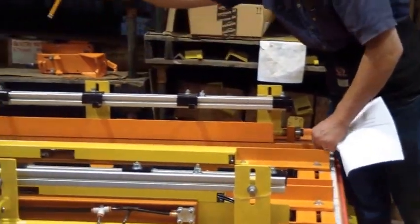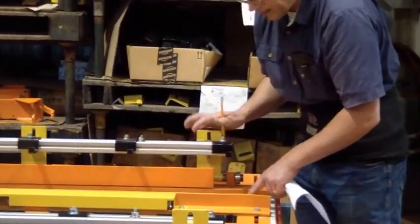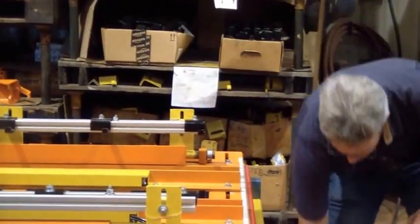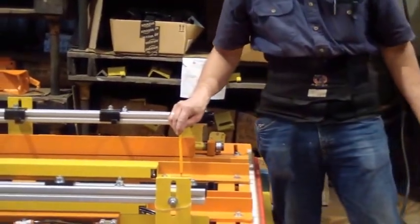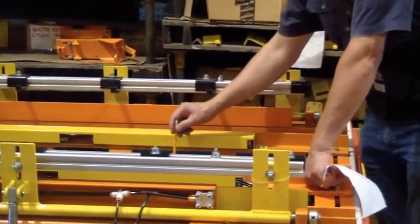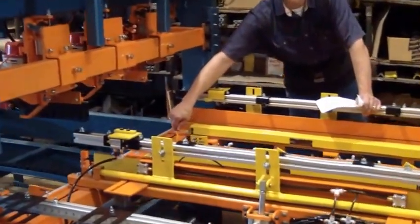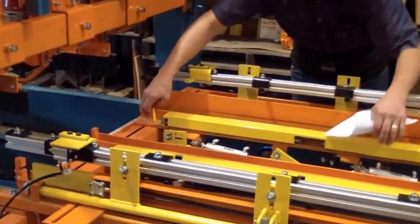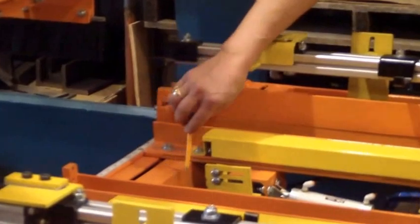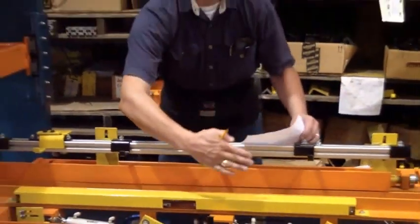There's 3 screws for that, 3 bolts. That sets this station. Then you have the same 3/16 to a 1/4 inch gap in between to set that. Your bottom board bar is set to 7/8 of an inch when it's flush with the top of the cart. You have a 7/8 gap. To get the stroke correct, you got to have that stroke correct.